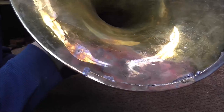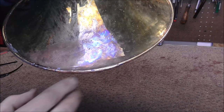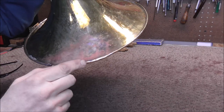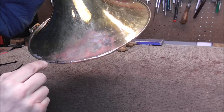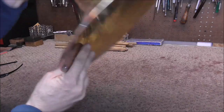I'm done soldering and there is my rather ugly solder joint. There's the other side from here to here — a lot of solder clumps, everything all over the place, and a lot of pink metal. I have to buff the metal to get the pink stuff off. I'm going to buff that by hand — I'm not going to use the buffer for this because the metal is so thin already and I do not want to thin it out anymore. And then the clumps of solder, I'm going to heat those and then wipe them off with a cloth.